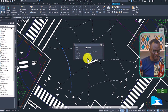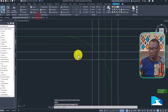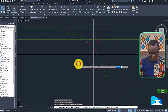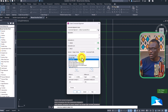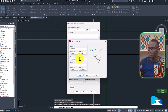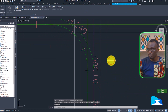We assumed an offset of six meters. So we're going to use 19. These other ones were roughly 60. We're trying to create the same thing shown here. Come here, create connected alignment, select this, select this, hit enter. We use a three-center arc: radius 19, radius 60, radius 60. Click OK, and you can see it has created something very similar.